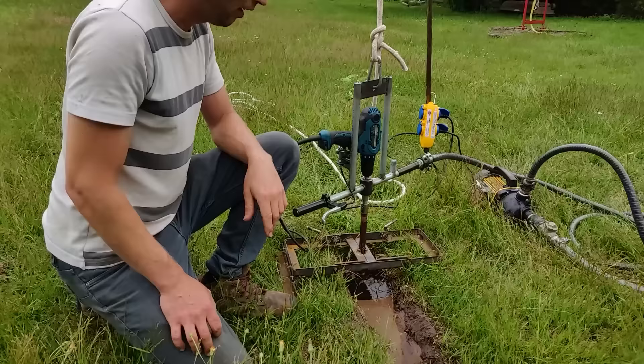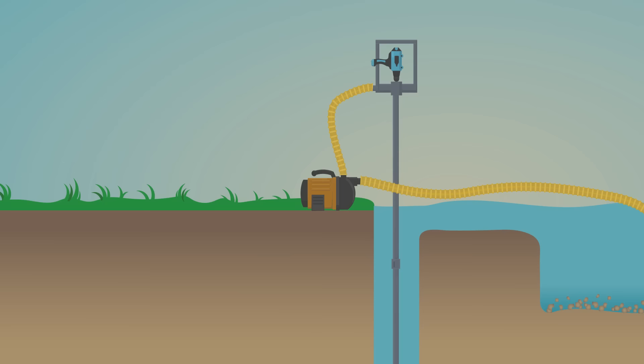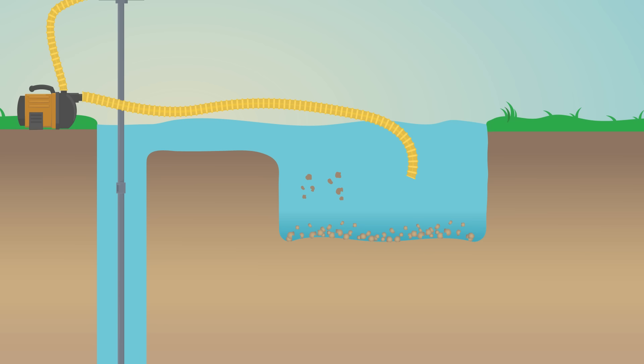In the trench we have dug, you can find the sand and the mud that we drilled out of the hole. When we turn the pump on, water comes into the handle here and exits at the lower end of the drill stem. Water takes away all the cuttings and particles of the soil, which go through this canal to the mud pit and settle there.